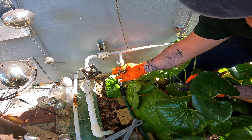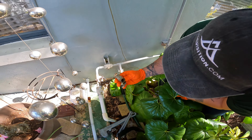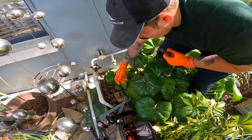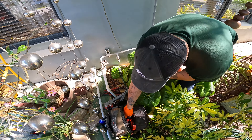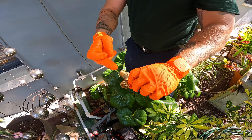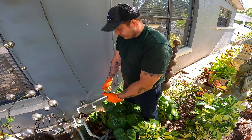I'm a big fan of having a sweated copper female adapter whenever you have your hose bibs outside, because it just makes changing them out so much easier. Look at that — that was pretty straightforward. So that's done. Here's the old hose faucet — that's trash.